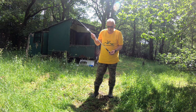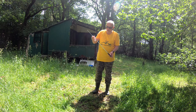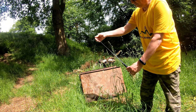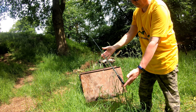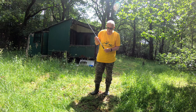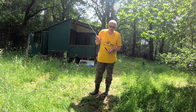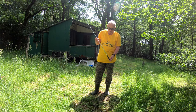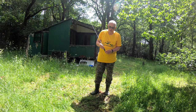If you're just starting out in the hobby, this type of whip antenna may seem an ideal solution if you're about to go out portable. After all, it is small and compact when collapsed and even when extended it's not that long, and they're usually monoband. This particular one is designed for 20 meters, although you can get some much more expensive types that cover more than one band — I think Elecraft does one. They're a compromise, and the compromise comes in the fact that the radiating part of the antenna is very short compared to the wavelength.